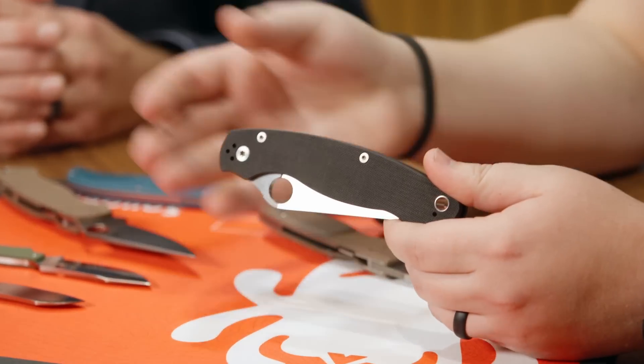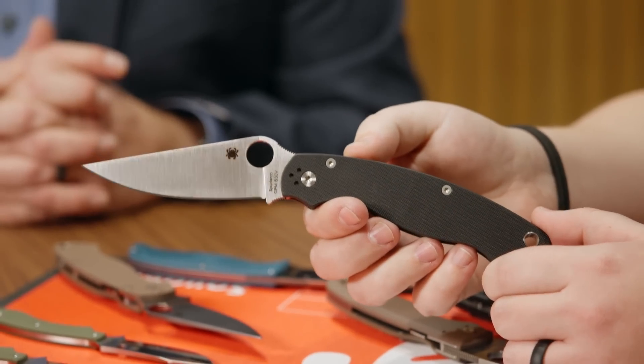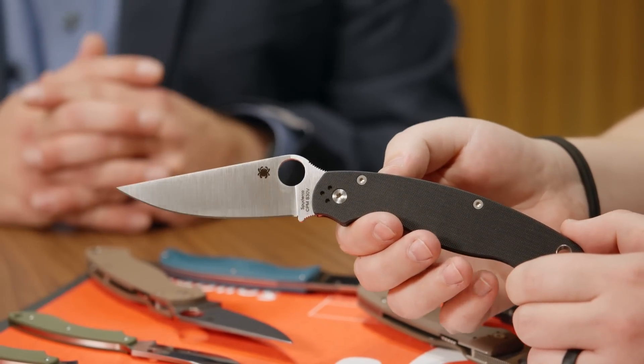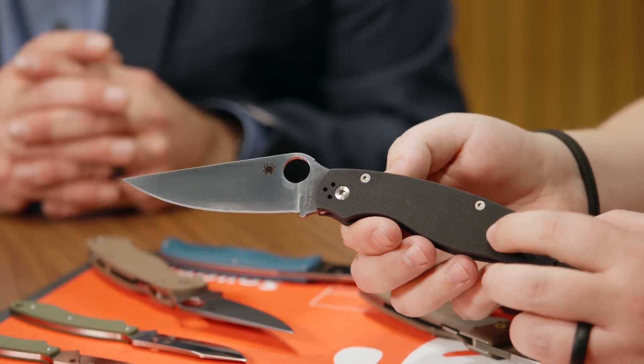I think the military, mentioning CQI, is the story of Spyderco innovation. If I understand correctly, that was the first production knife ever to have a particle steel, right? It was - that was the 440V. We've come a long way, everybody. Maxamet 15V, that stuff is hard to work, but I have more nightmares about working the 440V back in the day. We've come a long ways in grinding and capabilities since then.